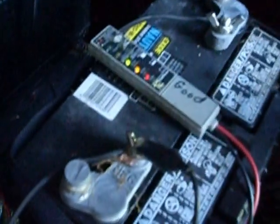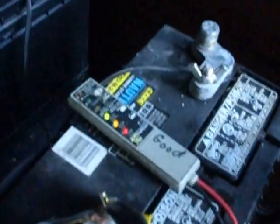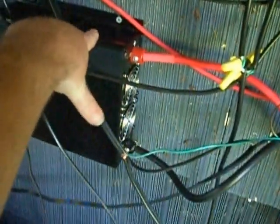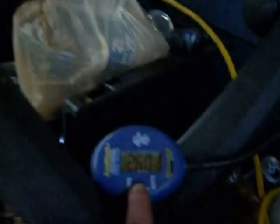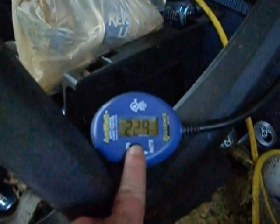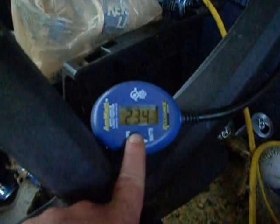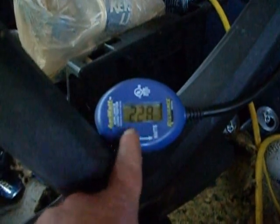Got my battery down here. This is battery voltage — we're at 12 and a half volts right now. It's all slapped together so fast, but here's my inverter. This is a 1500 watt modified sine wave. Right now it's running my man cave there. No problems. I'm pulling around 200 to 260 watts — it's all over the place. This is what I'm pulling to my man cave off of my inverter here.